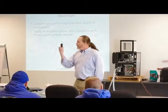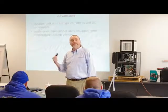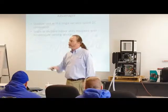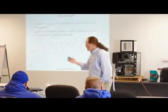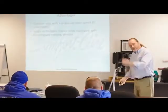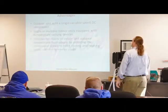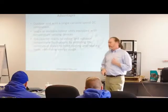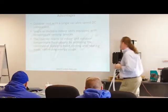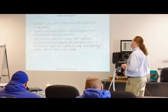You can make the remote control your temperature sensor. It has a feature called the follow-me mode, and I'll get into that when we get into the remote control. The thermistor — your temperature sensor — is in the evaporator. That's the point where we're sensing room temperature. The inverter reacts to both indoor and outdoor temperature fluctuations by adjusting the compressor speed to meet cooling and heating loads, optimizing energy usage.